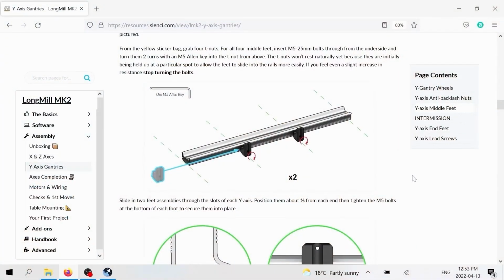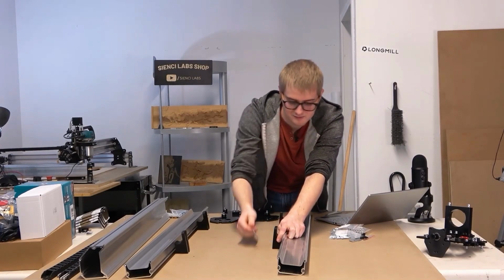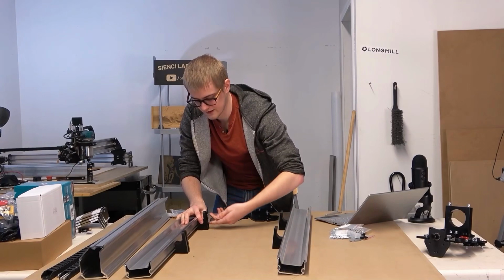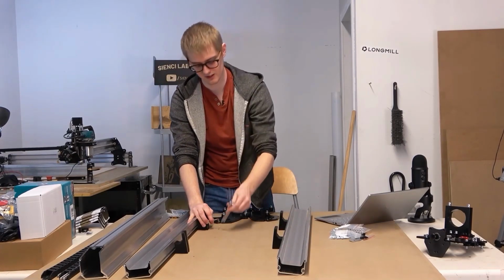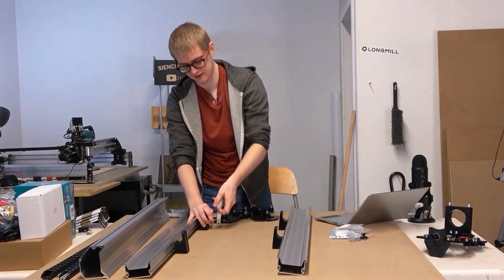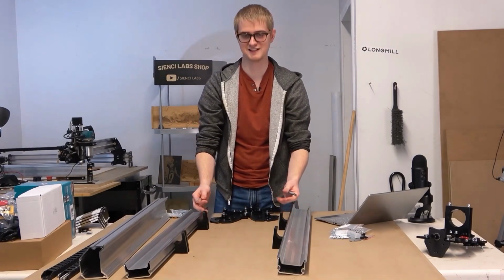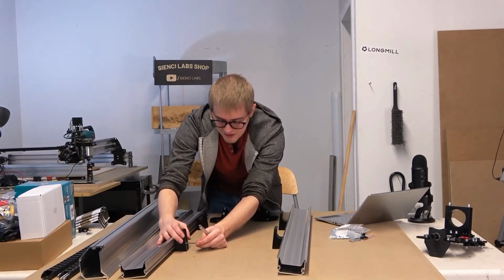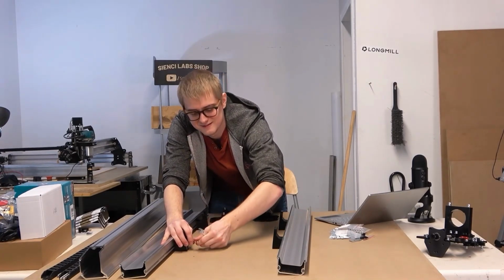And so notice once again, we've got the red tightening arrows here. And so that's what I'm doing, is I'm tightening them all the way down. These will be a bit harder to tighten down because you're using the long end of the Allen key instead of the short end, but just give them a nice solid twist all the way down so that you're confident that they're seated properly. And if you really need to, you can take the wrench here, put it in the circular hole of the wrench, and you can give that a twist to get some extra leverage. But don't go too hard on it, because these are plastic feet. You're using a metal piece and another metal piece to bolt on a plastic thing. And so if you really ream down too hard, you can start deforming the plastic or even break it. So you just use caution.